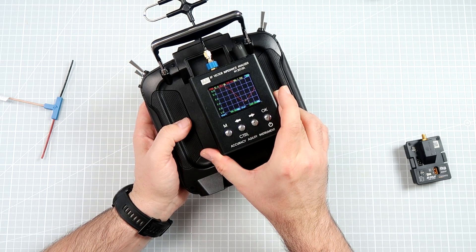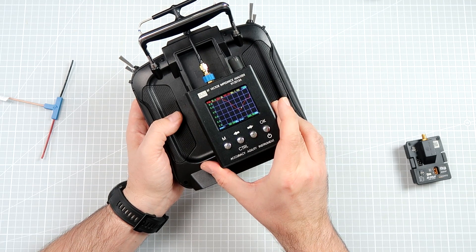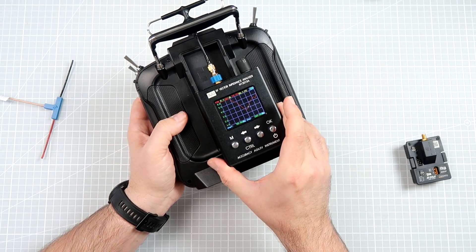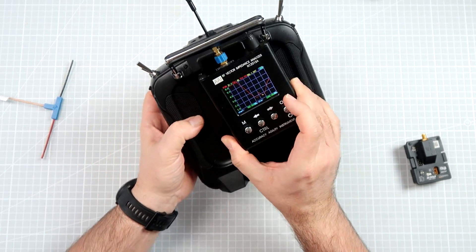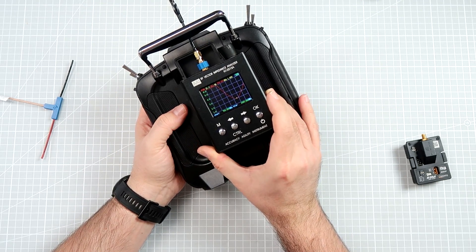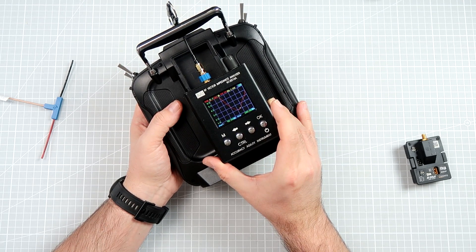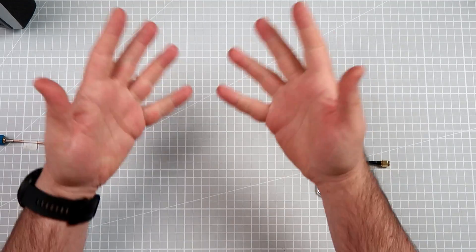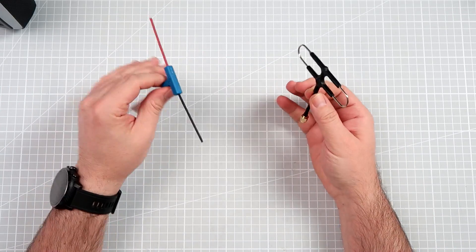Let's repeat that comparison. When horizontal, the VSWR rises rapidly — even to 3.0 — and the antenna loses tune. In the case of the vertical antenna, not parallel to the carrying handle, the effect is there and the tune gets worse, but not nearly as bad.